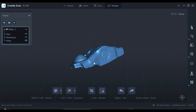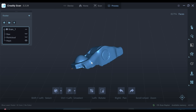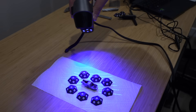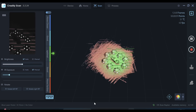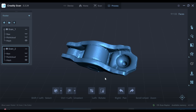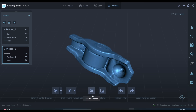You can even see the texture on the paper towel it was sitting on. After trimming away that data, the final result definitely has enough detail to reverse engineer things — even some little dirt specs showed up in the model. I tried the infrared mode on just rough models — we'll see that in a minute. Here's the bottom side: once again really good detail getting up inside there, definitely enough that you could come up with a mating part or fixture off of this scan model.